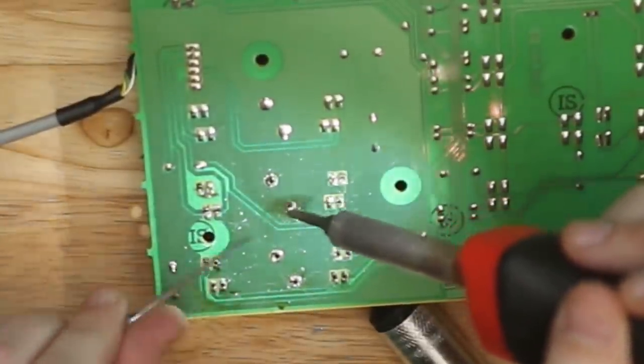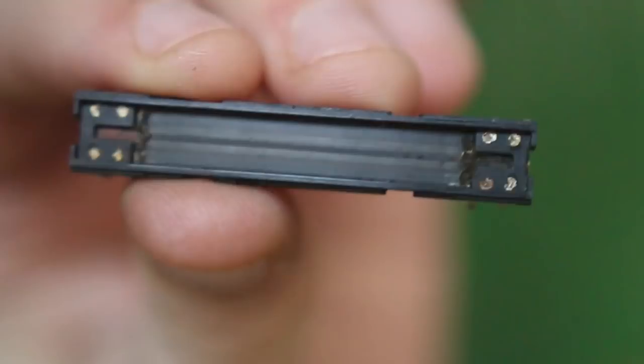But once I had them out, I took one apart just to see the inside, maybe clean it. But you can see that you can hardly tell that there's individual tracks. It should be sort of a copper color. They shouldn't be flat black like this. And I don't know if that was a dust cover disintegrating or dust and dirt stuck together with fader lubricant or just oxidation. Who knows? They were gunky and they were not working at all.